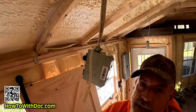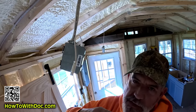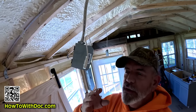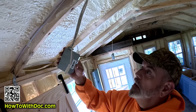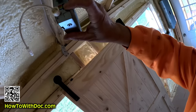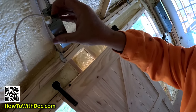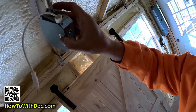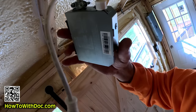The other thing I almost forgot to do — these pancake lights have an adjustment on them on a Kelvin scale. 5,000 is really bright white and blue, and you go all the way down to 2,700, which is very, very yellow. There's a little switch right here — it shows blue versus red. I'm going all the way up to the furthest one and then one click down — that's what I'm doing on those.